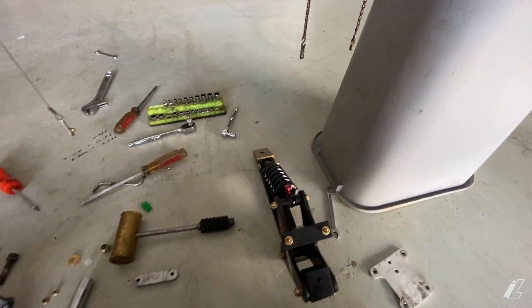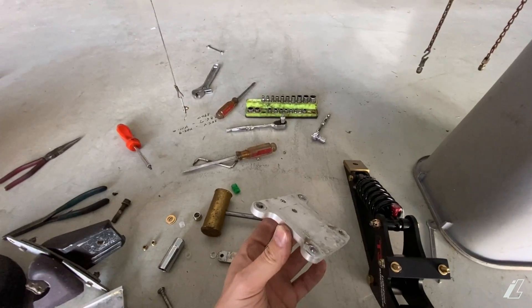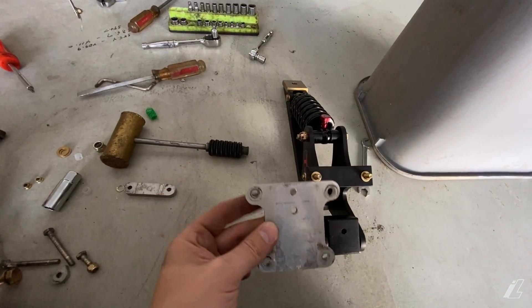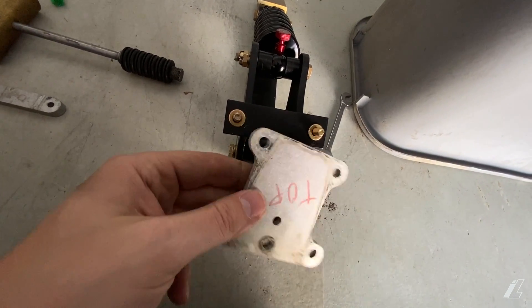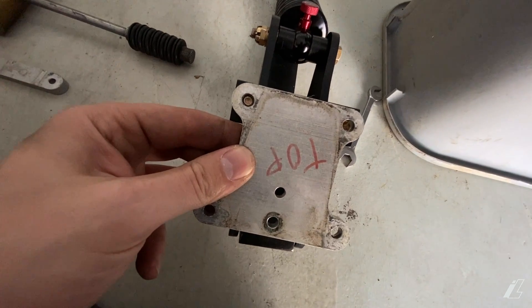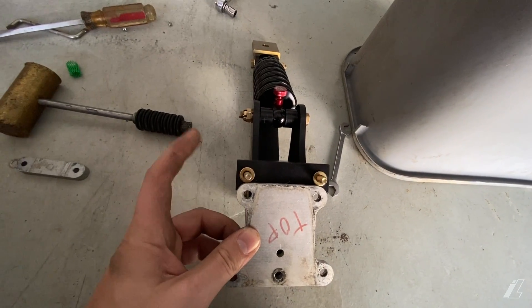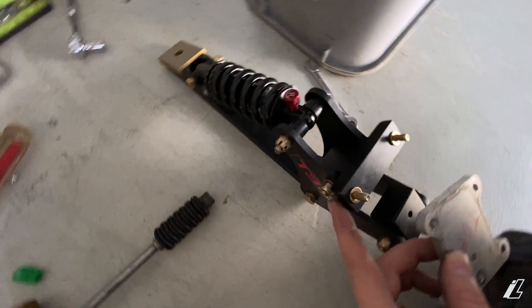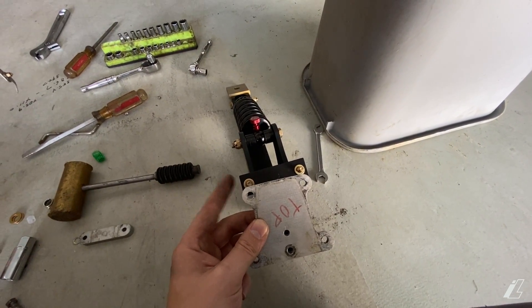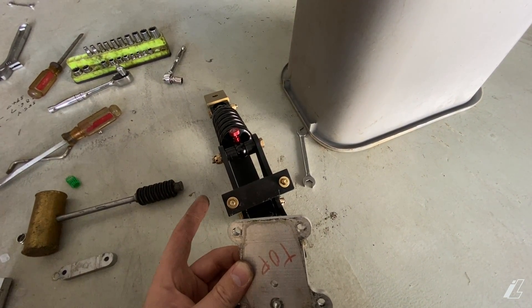Things got complicated — they always do. This little quarter-inch plate goes up on the bottom of the fuselage and the tail wheel spring mounts on it. I did a measurement off of this, and unfortunately it looks like it was slightly off because the T3, which is supposed to mount like that — if I line it up here, you'll notice it is a little bit off. In other words, the T3 is a little bit wide. I'm going to take this home — I've got a couple of options: I could slot this, or I could make a new replacement for that single piece. I need to take it home and figure out what we're going to do because unfortunately it's not going to mount right up.